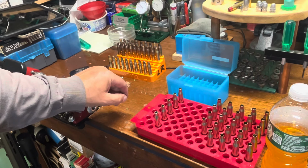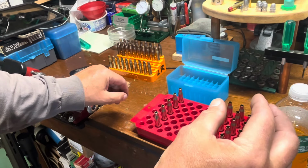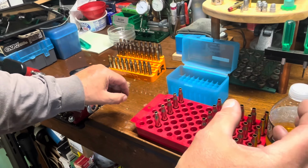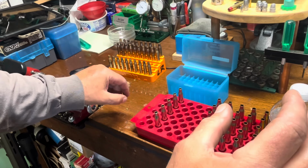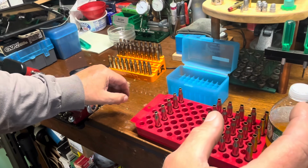That's a real thing. Basically what it is, it's a rifle that's been shot a lot. The lugs in a typical bolt action are two lugs in the front, and they go forward and they rotate. Well, when you fire, those lugs hold everything. They hold the bolt from moving. They hold the pressure. They hold the case forward. They hold everything. And what happens is they pound on the receiver. And what it does is, to oversimplify, they dent the receiver.